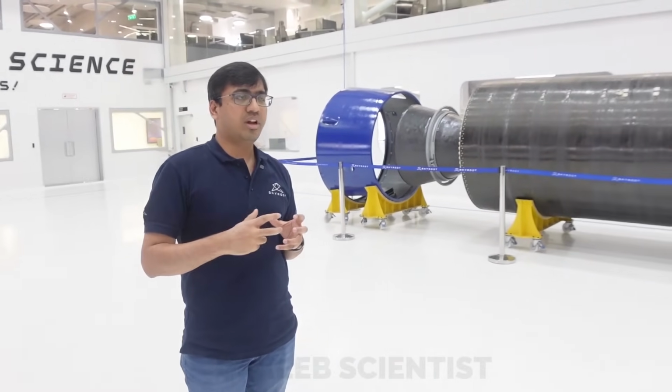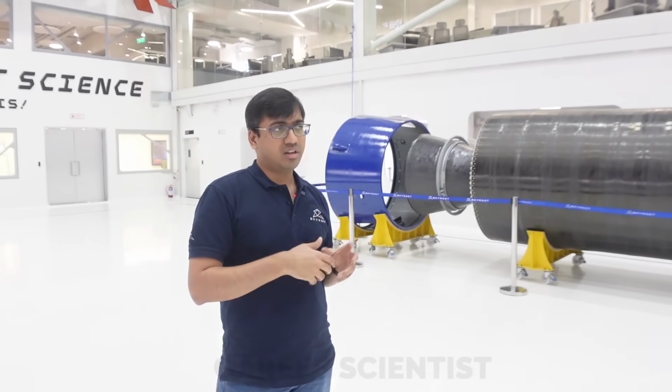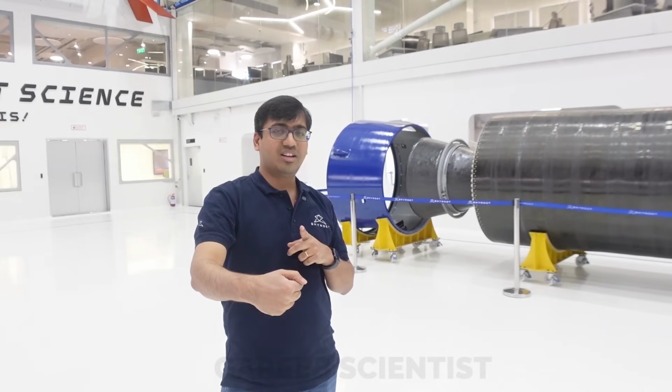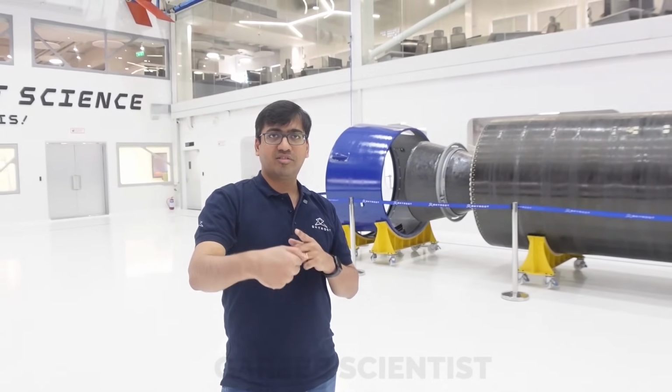So you have two actuators, and we have two additional sensors called LVDTs. For solid motors, they are called mirror imaging sensors. Exactly opposite to each actuator, there is one mirror imaging sensor, so it will exactly mirror the movement of the actuator.